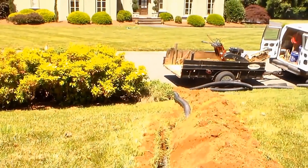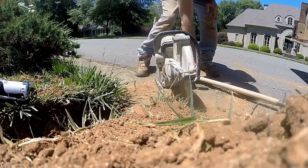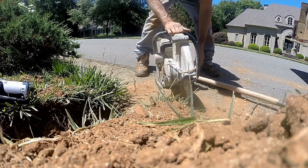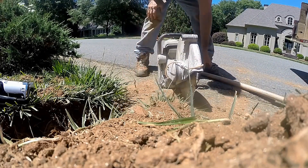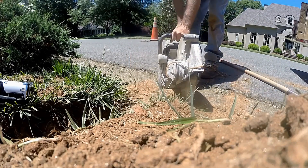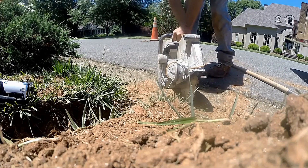Here at this tee, it all comes together with great fall coming down. The trench goes all the way out and we'll discharge down there. We're going to make a V-cut in the curb. We've come to an expansion joint right here — we'll use that for part of our V. Let's go ahead and fire up the saw if we have enough fuel.